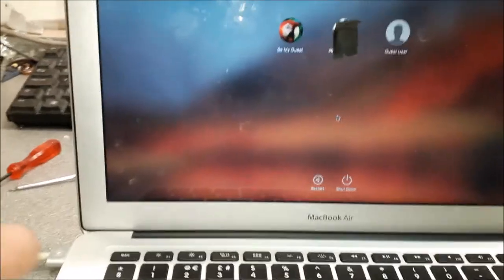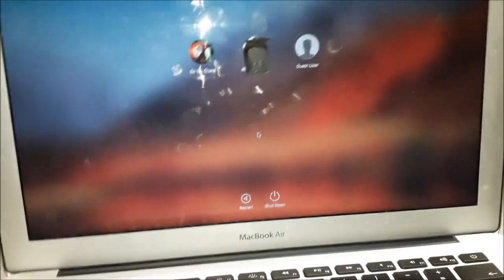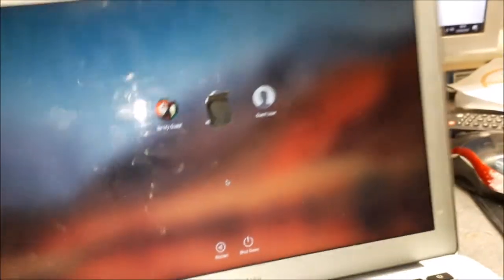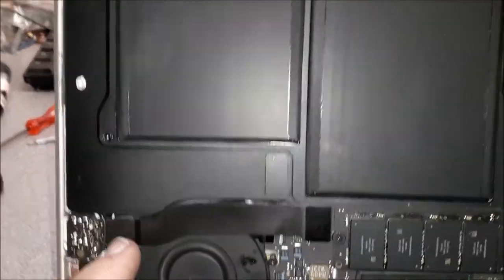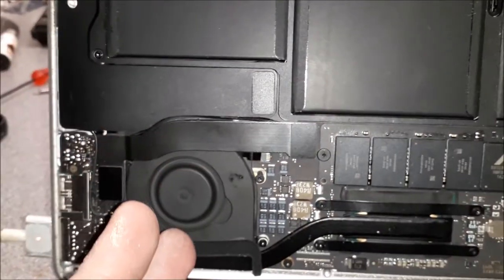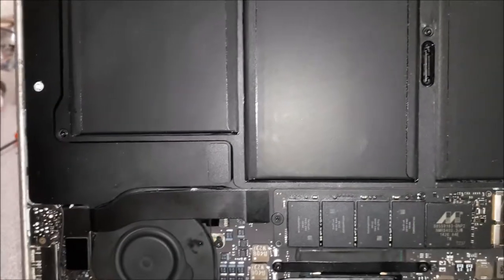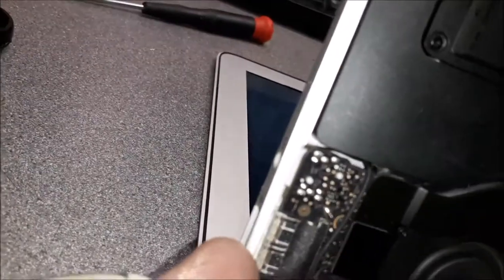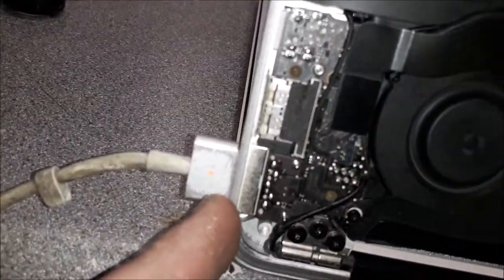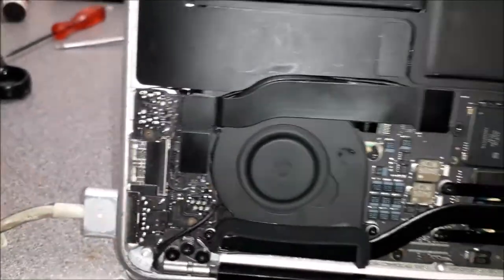Sometimes you just take the cable out first, so then you guys can see if there's a problem with the sensor. This machine doesn't need the data cable to work, okay? It will power on, it will light up the screen, but you will not have sound, for example. And of course, the USB will not work, and the lights as well will not come on green or orange.